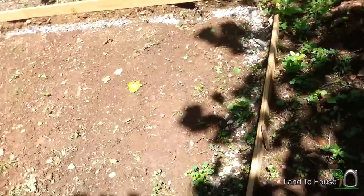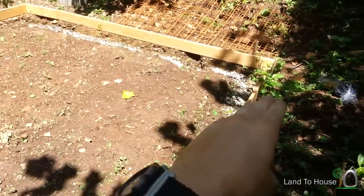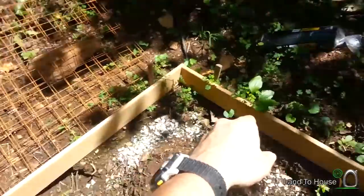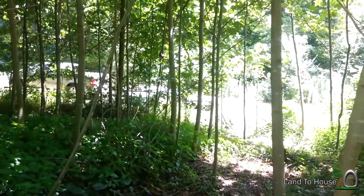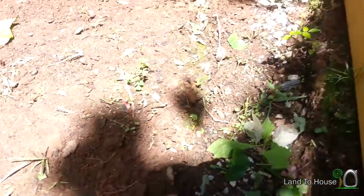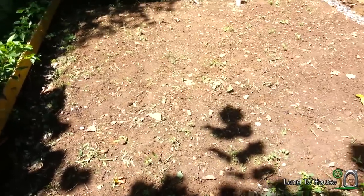We are currently standing in my future storage building spot. I've got the wooden frame set up here and this is my first attempt with concrete ever as far as making a pad goes. I've got my wire mesh, my moisture barrier, and then I've got a truck over here with gravel. I'm going to put down a base of gravel first, and you can see I've got a difference in height from in here versus up here, so it'll be a little bit thicker concrete down there. Let's get to work putting some rock down in here.